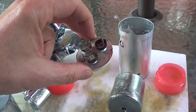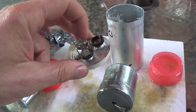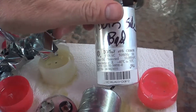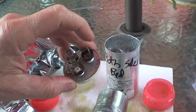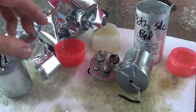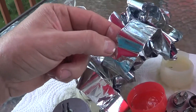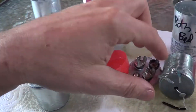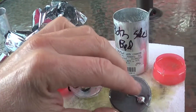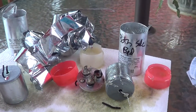So you can verify when you put a capacitor in — check the voltage. If you're over 440 volts, that capacitor is going to blow out really fast. If you put a larger capacitor in, the voltage tends to spike higher. So whatever you take out — if you take out a 30, make sure you put back in a 30. They tell you to go oversized, but that raises the voltage. Going undersized will lower the voltage and probably give you a little longer life, because the voltage gets high enough where it arcs through the plastic and starts degrading itself — until eventually the capacitor overheats and blows its top, or it'll unsolder one of the wires and go totally open. That's the failure mode we all see on these run capacitors.